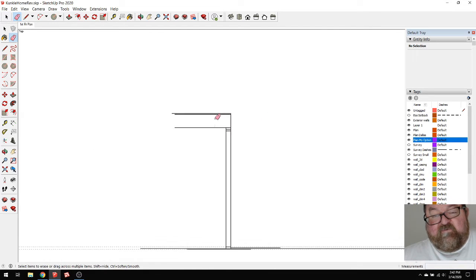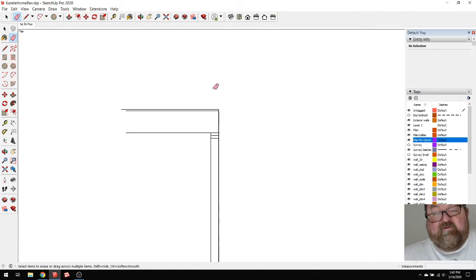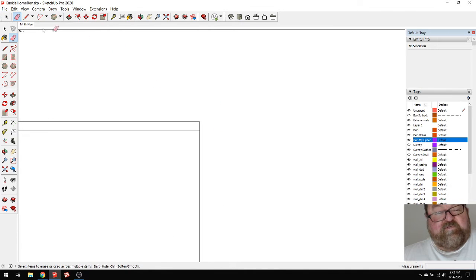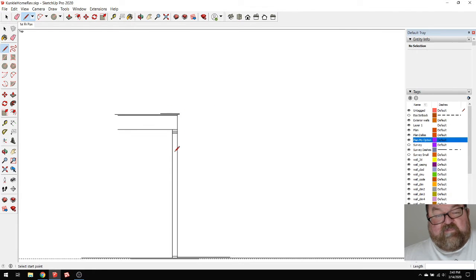So that's how we get the height of the wall. Okay, so then you say, okay, well, we got to have a stair. The easiest way I've found to do this is, for demonstration purposes, I'm going to show the finished floor up here hanging out. It's going to be 1 3/4 inches. Let me just redo that, and I'll show you why later. 1.75. And we go up 3/4. Actually, that'll just be our flooring thickness, because our bull nose would hang down a little bit.